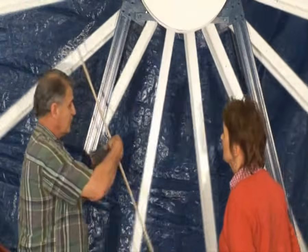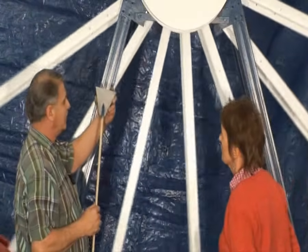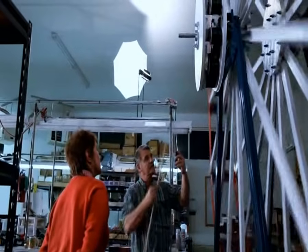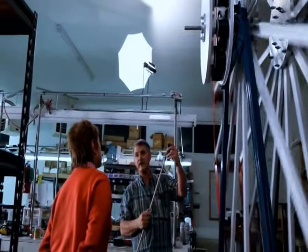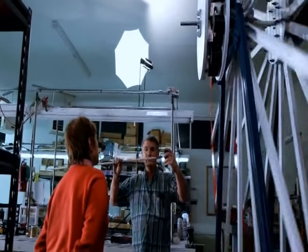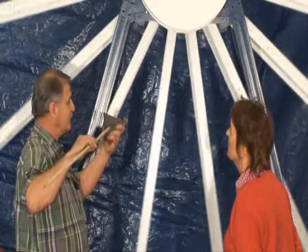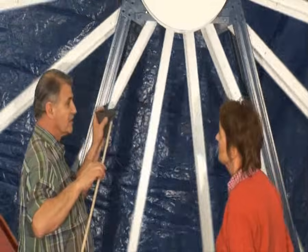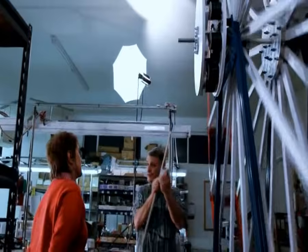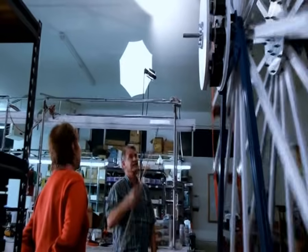Yeah. So we come by, we hit the barium ferrite magnet with these poles in this arrangement. And we hit this barium ferrite magnet, and what we want to cause it to do is send a little signal in here and make the magnetic material inside flip poles. So it does it really quick. And that's the shaking you see, because it wants to turn around on there and it can't turn. So it just shakes. So you understand that now?